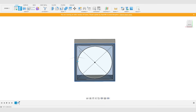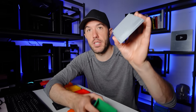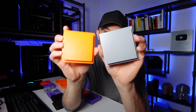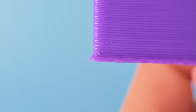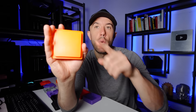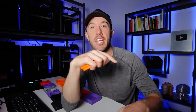Let's run through all the variations of how to design both the base and the lid so that you get them to fit exactly how you intended every single time, regardless of what material, color, or machine anyone is using. Starting with the baseline simple CAD model — a square base and a square lid — this is really poor, entry-level design. The very first thing you want to do is round all the edges. This eliminates warp around corners and removes contact stress areas, because as the nozzle goes around it can bounce or have flow delay, causing sharp corners to become dimensionally inaccurate.